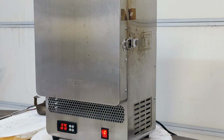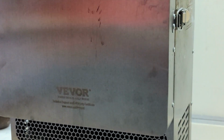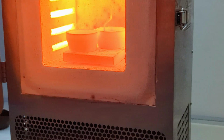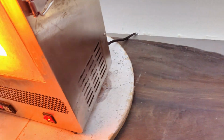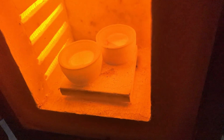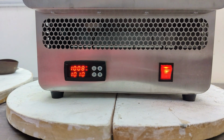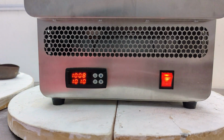During this smelt, I've noticed a difference between the lead and the bismuth: it is more fragile when breaking off the slag. Let's try to take a quick peek. See how the progress is? Looking good. That's how they're supposed to look. The kiln is at temperature. I will set a 45-minute timer and then check on them afterwards.